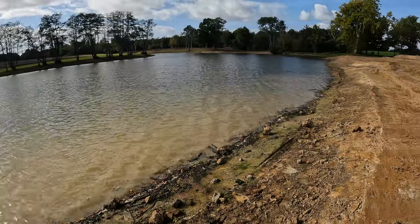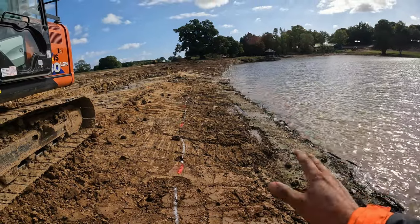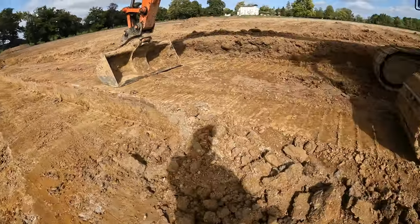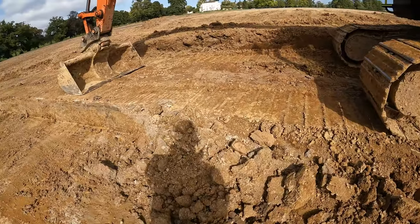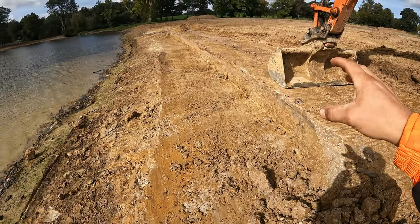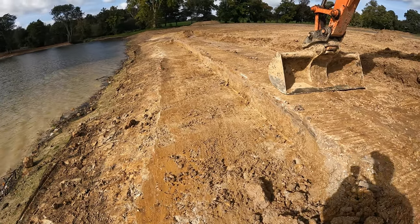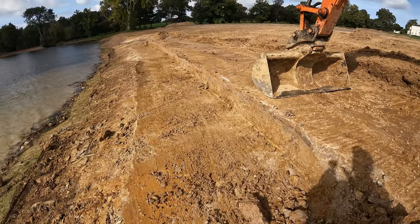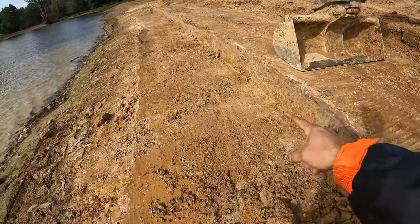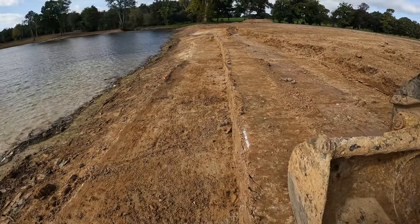That's just lovely. Alright, so we've done the bank over there, and it's all cut out. Lovely. What we're doing now, we're gonna have a retaining wall here. A 2 foot high wooden retaining wall. And immediately next to it, a footpath, a buggy path, so it's gonna be about 1.5 meters wide, and that's the bench where I'm sitting. That's the footpath, and the retaining wall is gonna come against it right here, as you can see.